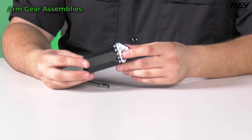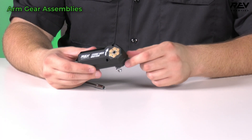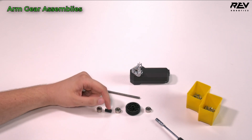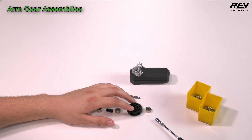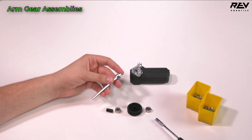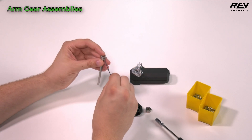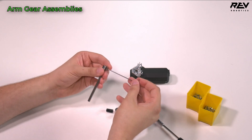And there we have our core hex motor fully preloaded with the bracket mounted on — that will just go into the robot. Moving on to the next step of getting the gear on it: we're going to take some 5mm shaft that is 90mm long, three total shaft collars, a 15mm hex spacer, and our 45-tooth gear. I'm going to find the set screw and take my 1.5mm Allen key — making sure I get the 1.5mm — and ensure the set screw is hitting the flat side of the shaft, putting it about flush for now.